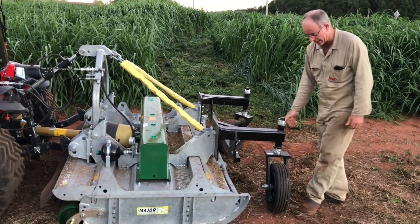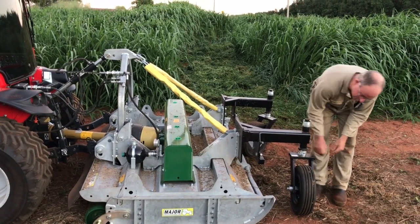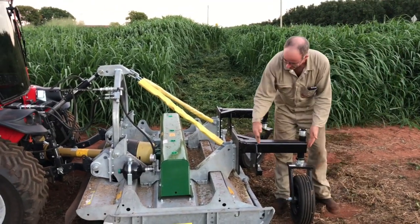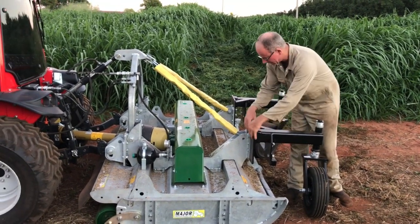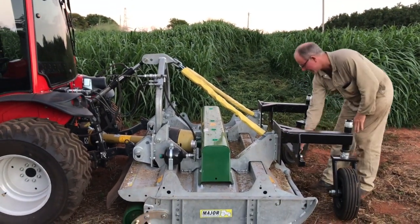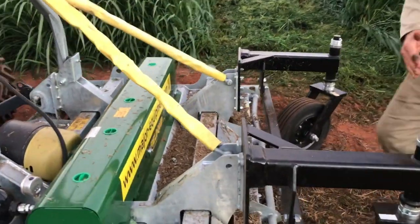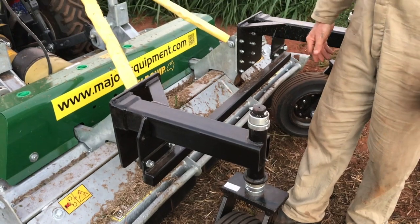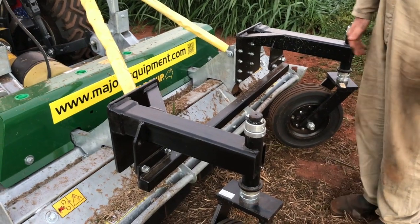And then we've made these caster wheel assemblies. Now they're just from Bearco. There's a part number B6556 for that assembly. That wheel, that's the 400 mil diameter wheel, that's from Bearco, and that frame back to there was from Bearco. We've cut and welded that plate, made up that plate to mount it onto the Cyclone. We've made that brace across there just to reinforce it, and we've made it as strong as we can. We think it's the right combination of weight and strength, but we kept it as close back to the mower as possible.